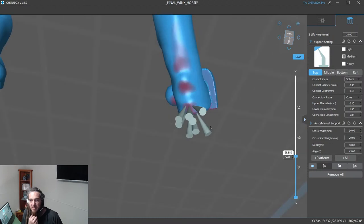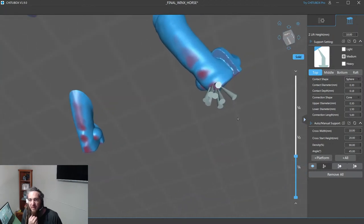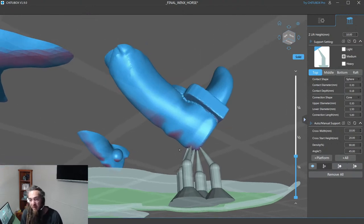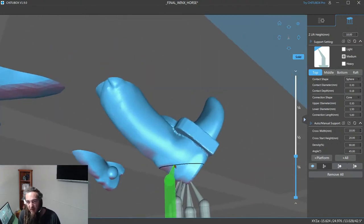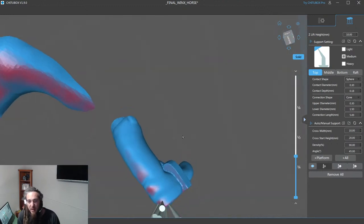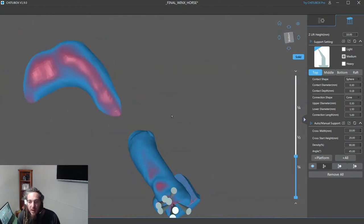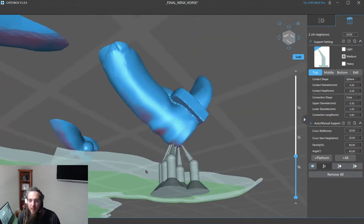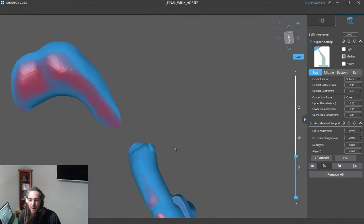If it's a really delicate spot, then obviously it's a bit of a tough one, where you might have to print it in a different orientation if you have a really delicate feature that's your very first point of contact. But, yeah, just looking at that, that sort of shows that foot there is going to have quite a good little anchor to get started.